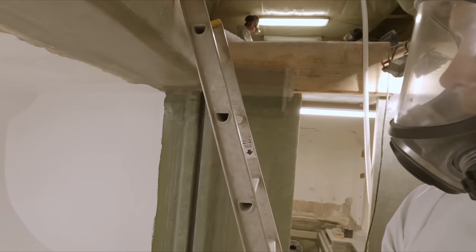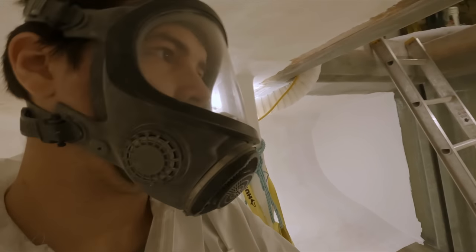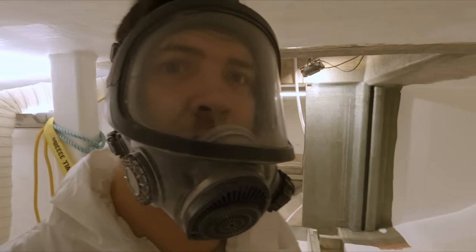All right, everyone. We just got our first coat of gel coat on the bulkhead here, as well as over here on the port side. Looks great. Got this sump over here done and the divider wall. So just waiting for this all to tack up, and then we'll put our next coat on. We'll do two unwaxed coats on the bulkhead chunks just for that extra thickness.